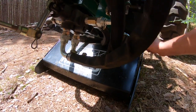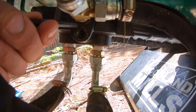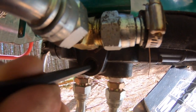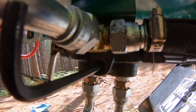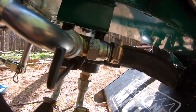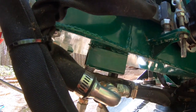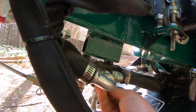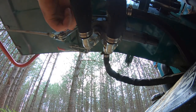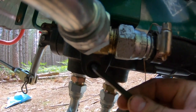So just a cap — I'll set it up there for now. You may or may not be able to see all the way down in there, but what's at the end of that long dark hallway is another six millimeter allen head screw. That screw needs to be tightened. We're going to tighten it by turning it clockwise until it stops — not torquing it down, just turning until it stops. Okay, that is fully stopped.